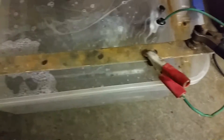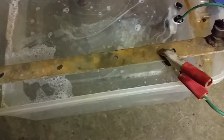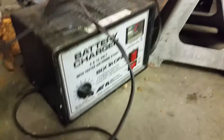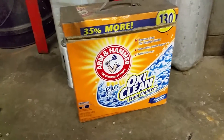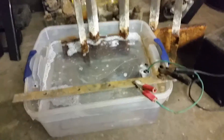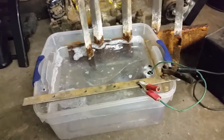Here's my tank and it's got this negative bar — that's what you always attach a relic to, or whatever item you're wanting to clean up, and that goes to your negative. And there's my metal plate that I use for the big iron pieces and everything. I just have it on a car charger and I use just this soap right here. I've read where you can do baking soda, I've seen people say do washing soda and everything else, but I've had pretty good luck with both.